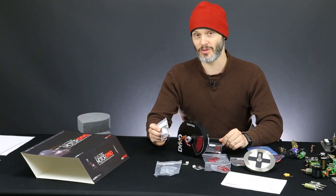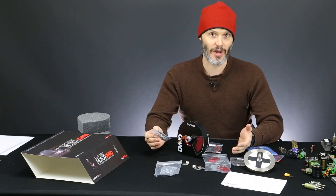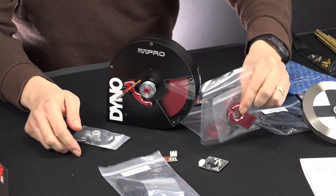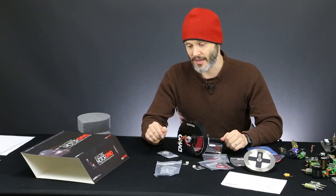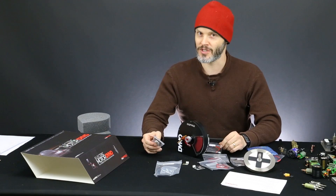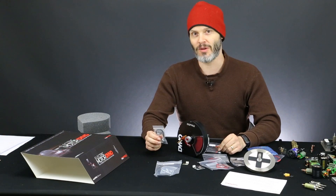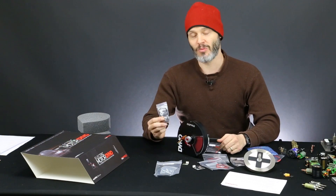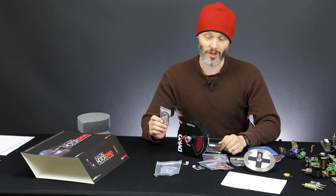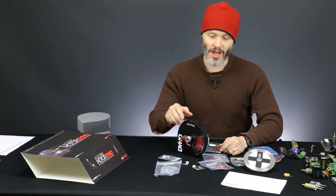The only way to account for that is a load cell — pretty much like what you'd have inside a scale that you step on. A load cell reads the torque coming off the motor housing through a little torque arm. These motor mounts, if mounted on a pivot, could actually be the torque arm themselves. This dyno does not have a load cell, so we don't get the benefit of that. However, I did hear that Mini Pro is working on a load cell version in the future, which I'll be working closely with them to get as soon as I can, because they're a little more reliable over the long term. As long as we keep belt tension even and bearings in good condition, this should be a very stable dyno — we just have to pay attention to the finer details.